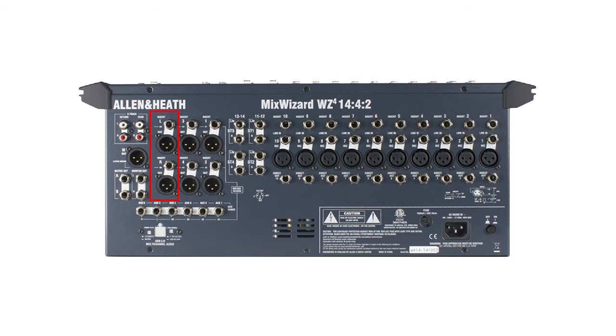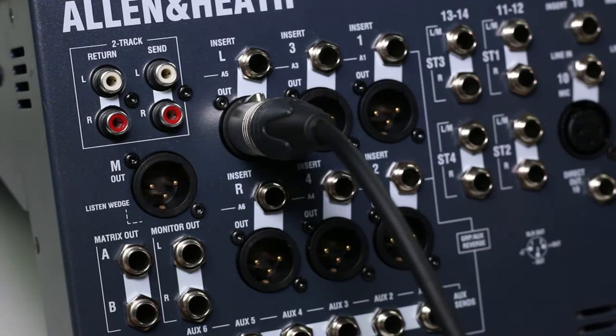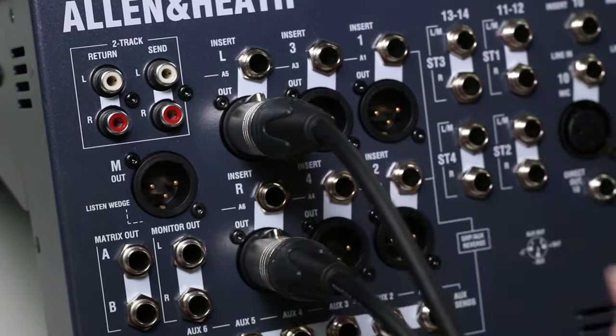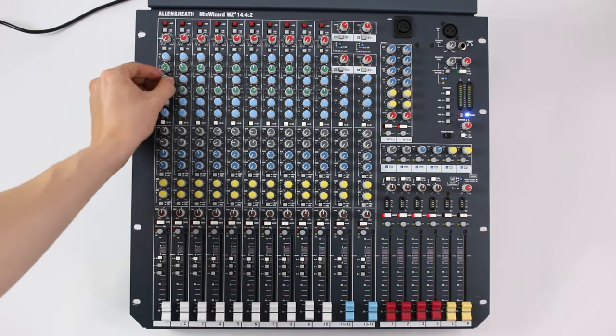In most cases, you'll be connecting your speakers or amplifier through the main outputs on your mixer — these might be labeled left and right. Later in the video, I'll demonstrate how to route an input signal through these main outputs. Before turning on the mixer, be sure that all of the faders are at their lowest setting and that all of the knobs are at their default settings. This is intended to prevent any accidental bursts of sound that can put your ears and equipment in danger of being damaged.